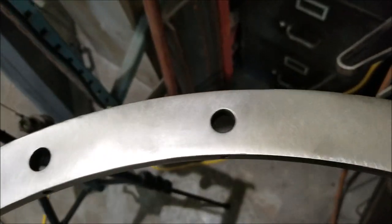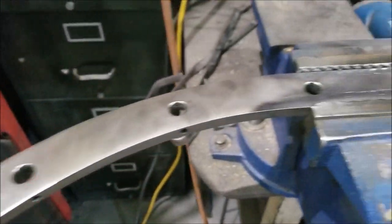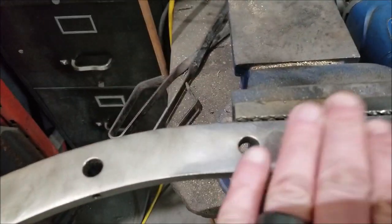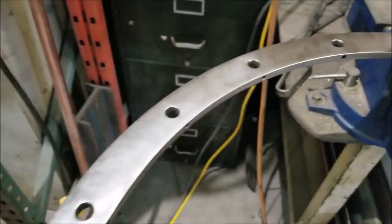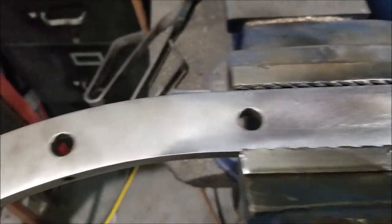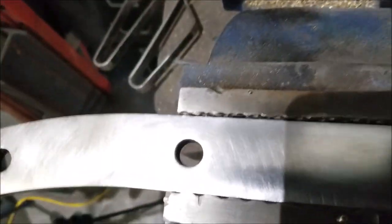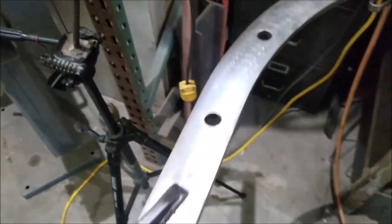So you can see it's barely taking. I don't know if you can see it. Got a slight brassy tinge on it, but it's cooling down way too fast. So either the oven's not getting hot enough in the first place, or it's just cooling down really quick. Like the vise is gonna suck the heat out of it. Its shape is like a giant radiator, so